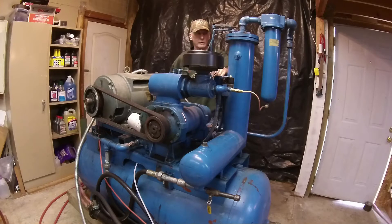I've run this a few times and there were some tricky parts. On a reciprocating compressor you have unloader valves at the top of the cylinders, pistons going up and down, a crankshaft that pumps air — everybody understands that. When it unloads, it unloads. So like that 25-horse air compressor I've shown in other videos — I can idle that compressor at 30 amps. The 10-horse runs 10-12 amps when it idles, then it cuts in and pumps.